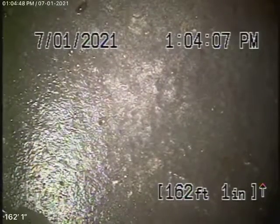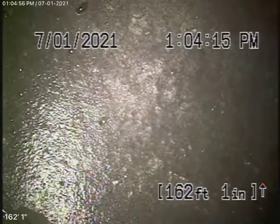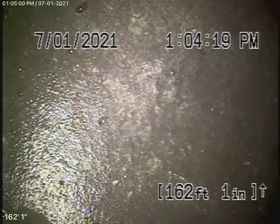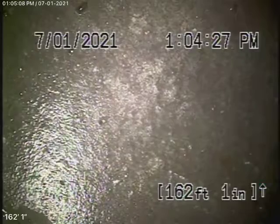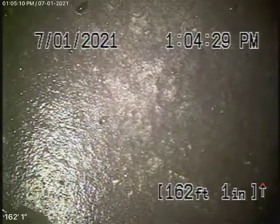All right, we're here at 212 North Catalina Street in Burbank. We're running our camera from the clean-out located at the back of the house by the ADU where the pipe exits the house. The lady of the house told me this ADU is legal and was all permitted. We're running our camera from this clean-out where it exits, all the way out to the city connection in the street, and it picked up the main house along the way.